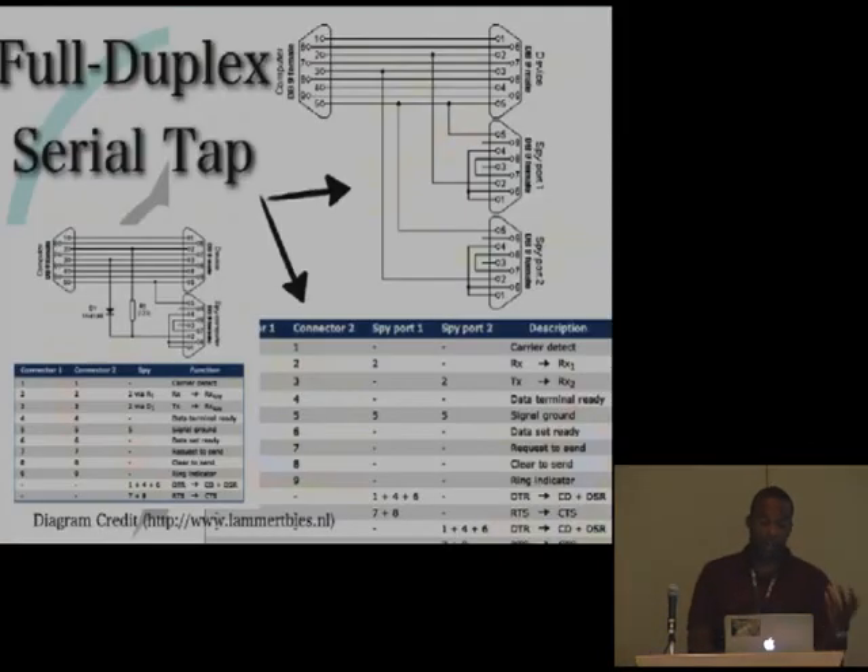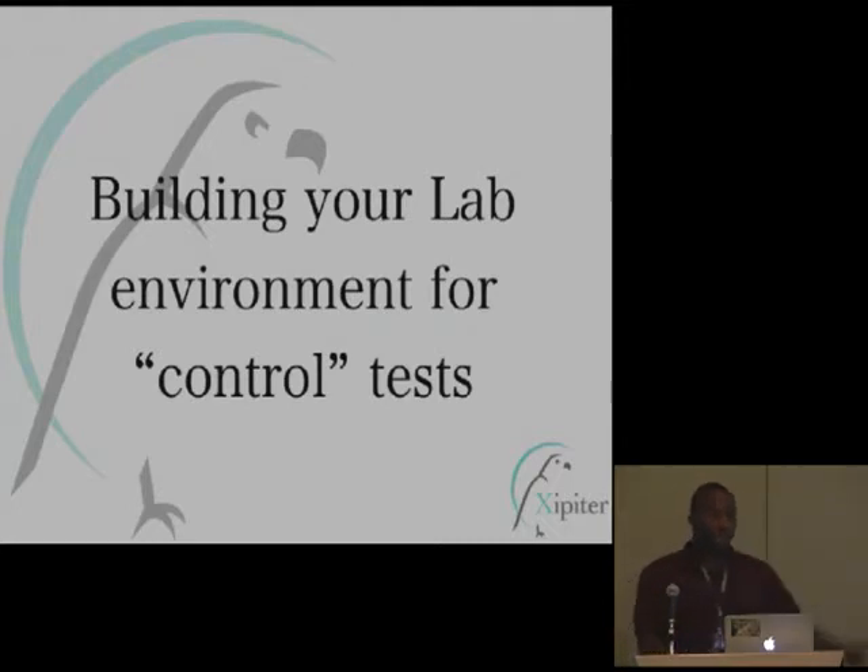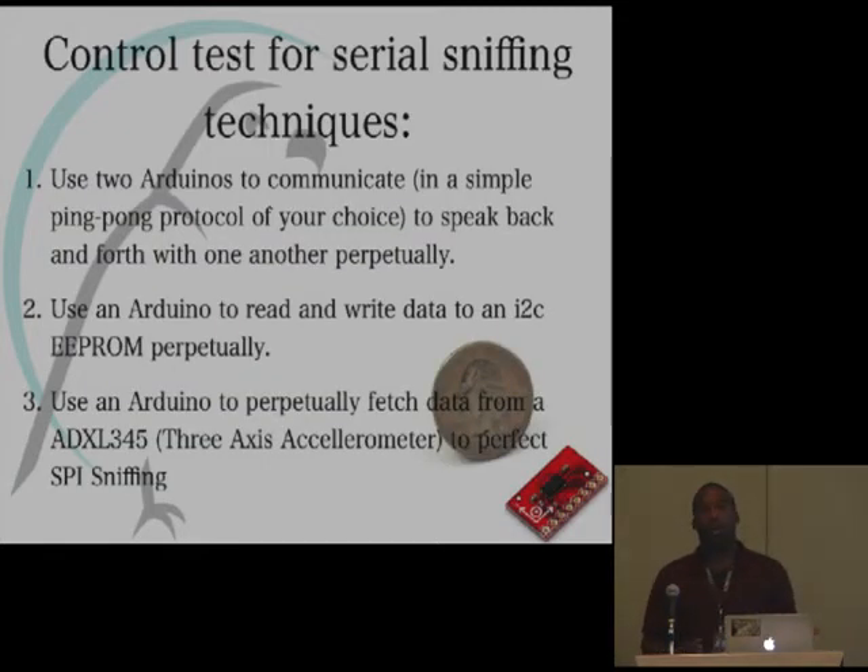Getting back to building the lab. The basic technique is dead simple — I'm writing this as if I was writing to myself six months ago. We're going to attach to pins we see and ask: what do those pins do? First, attach your voltmeter to make sure it's not some crazy voltage that will burn out our equipment. If it's something like 3.3 or 5 volts, you know there's something worth investigating. Then attach the oscilloscope to identify a square wave pattern — that tells you there's data actually being transmitted. Then connect the logic analyzer for more information, and if you identify it as I2C or SPI by running some analyzers, you can plug in specialized equipment like the Beagle.